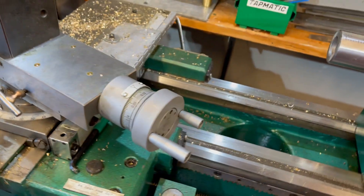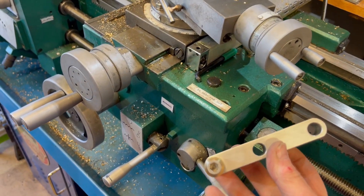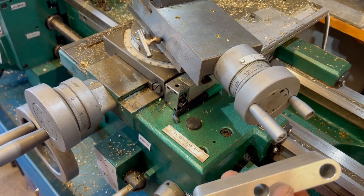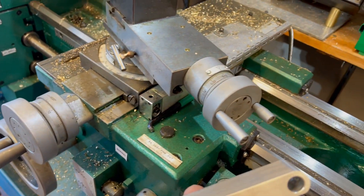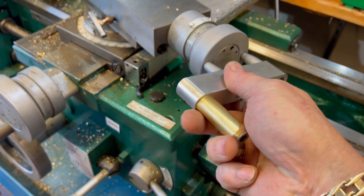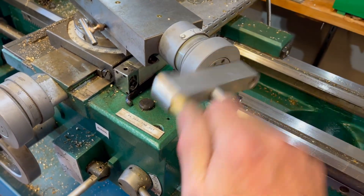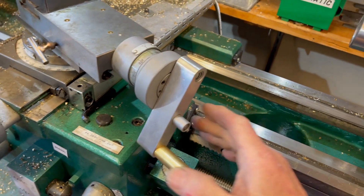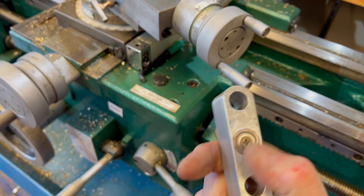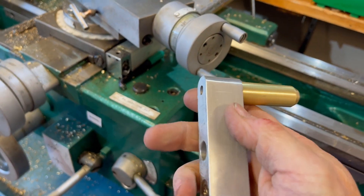So what I made was this — two holes, 19mm, a little over two inches apart. I used transfer screws, then screwed them in here and hammered this. So with this on here, it's just easy as heck. It's great. And then if you turn this all the way around and it's going to be in the way of the tail stock, just pull it off. It's got a magnet in the back right here that sticks on. The handle spins and it's just really easy.